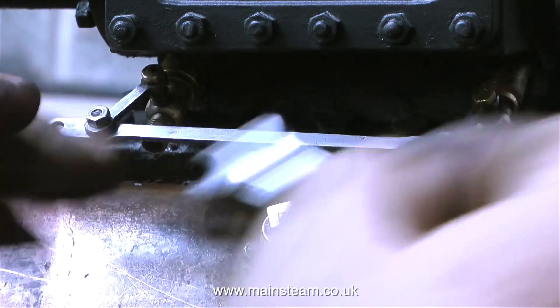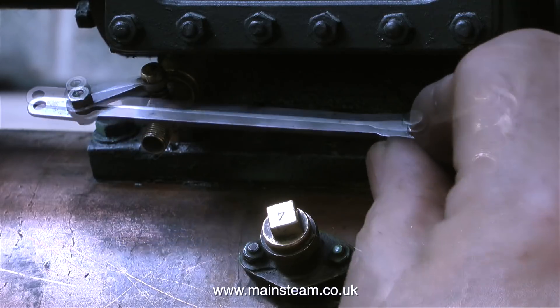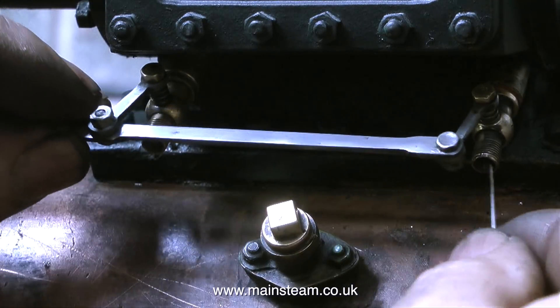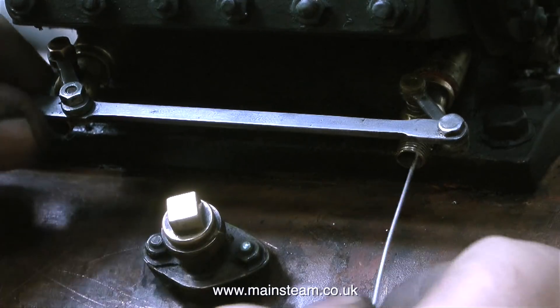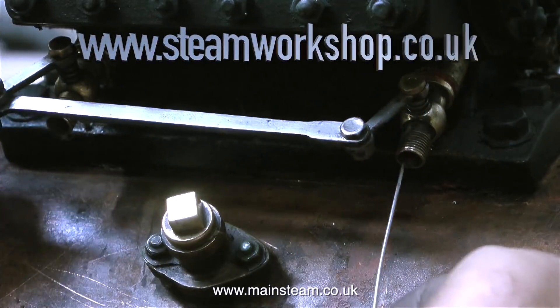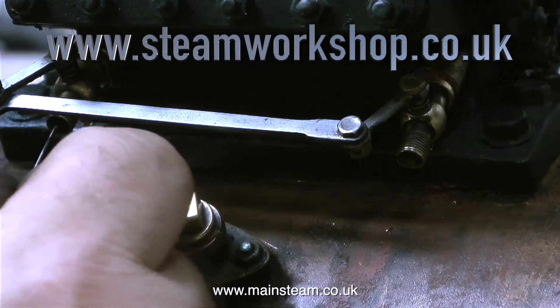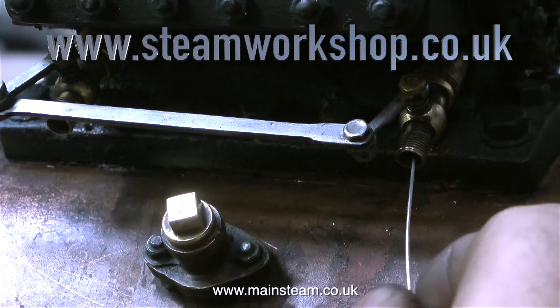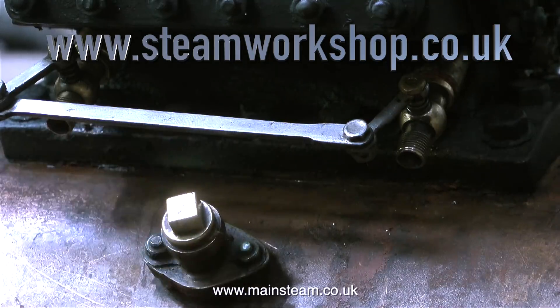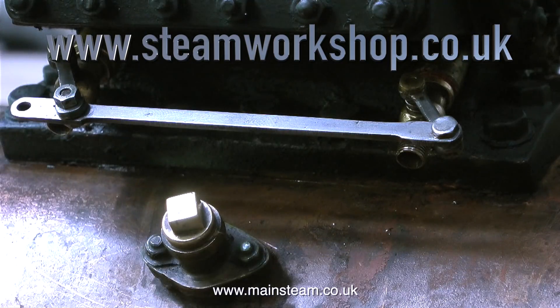What I have to do now is make sure both valves are in perfect alignment so that as I move the rod the valves open. I'm checking the position of the holes in the barrel by using one of these bits of wire I found near John's TIG welding machine — it's very important that these valves open and shut in sync with each other. As you can see, there's a hole all the way through up into the cylinder, and the arms are in exactly the right position so as I move the operating lever the valves open and shut at exactly the same time, which they couldn't have done before because there wasn't a hole through one of the barrels — but there is now.